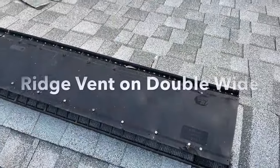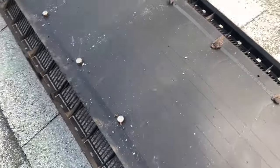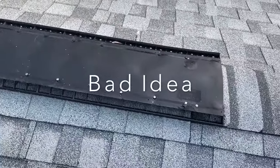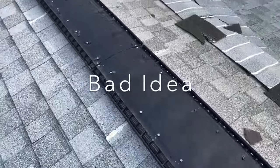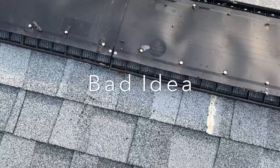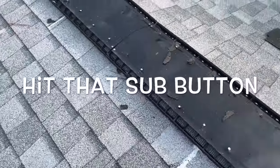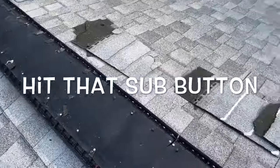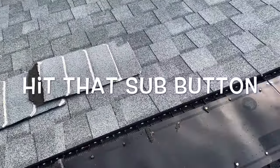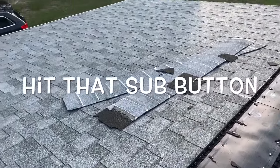Ridge vent from here to here is about 12 inches wide, which is the same width as your shingle. But up underneath there there's a good-size hole, which we're getting ready to show you. Of course they've been leaking, and he thought it was the shingles, so they've been caulking these lines. But it's not the shingles — look at this. Now tell me, if you have ridge vent laid down like this, what good is caulking that going to do thinking that's going to take care of the leak?